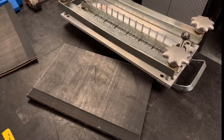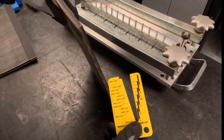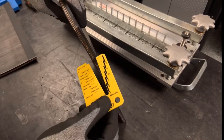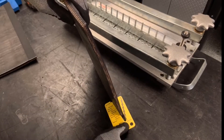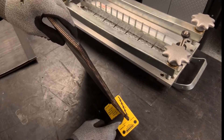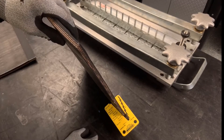First, we're going to measure the belt thickness. Here we've already pre-spliced for a BR-6 fastener. We're going to take our BR-6 rivet selection gauge and measure on the ends, middle, and other end of the belt. Here you can see that the belt thickness is referencing a B rivet and the max of an A rivet.